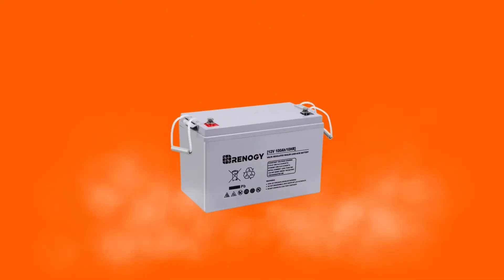Next we move on to AGM batteries. These are an improvement on traditional flooded batteries because they're sealed — no more having to top off liquid levels, no more potential battery leaks, and no more toxic fumes. Because you don't have to worry about leaks or off-gassing, you can store AGM batteries on their sides or in enclosed compartments, which completely opens up your storage options. They also tend to be smaller, lighter, and charge faster than traditional flooded batteries, and with typical use will last you two to three times as long. However, similar to flooded batteries, you're not supposed to discharge AGMs past 50%, so we're back to the mimosa problem. And AGM batteries are almost double the cost of flooded batteries, which can be a big investment.